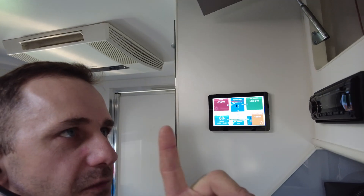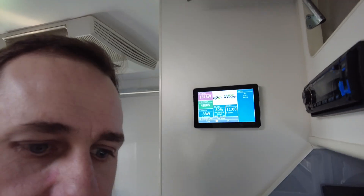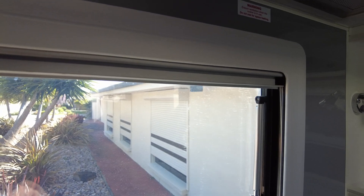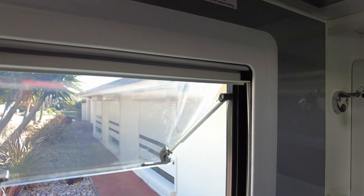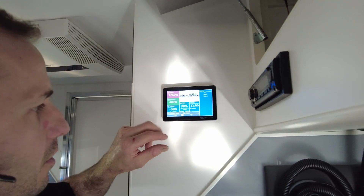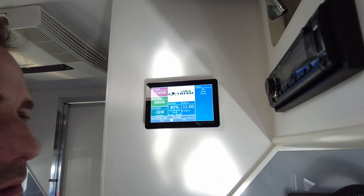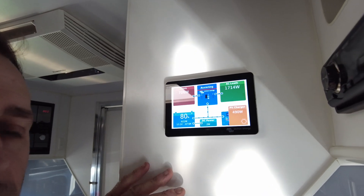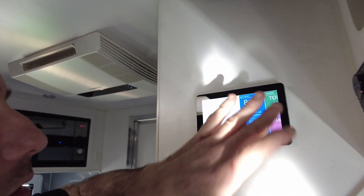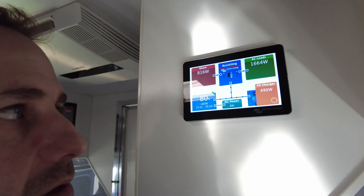I'm going to increase the current limit — let's try four. The AC current limit. I'm going to open this window so you can hear the generator. We'll crank this up — 3.5, accept. Hear it? Hear it load up a bit more? Now let's go to four — let's see what it does. Hear it load up? So now we're pulling four amps — it's using 800 from my generator. So if you don't want to run your generator flat out and really load it up, you can just drop it back on this. Obviously if you've got a Honda 2 or something, you've got a bit more room to go up, so you can put that current limit a bit higher. I wanted to show you this on purpose — that's my Jenny, I brought it on site for this test for this reason.